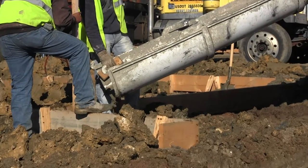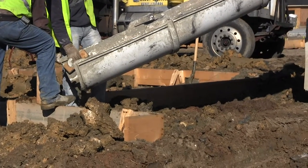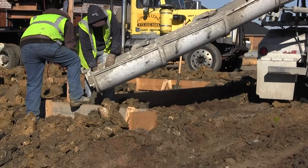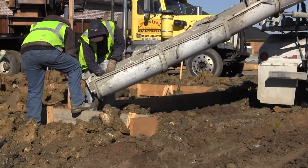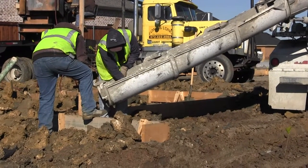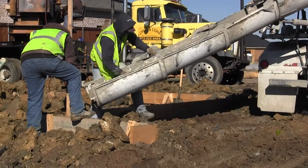By the way, it is January the 26th. The temperature is about 45 degrees with a moderate breeze from the north. We have extremely clear skies and humidity is low — comparatively speaking for our area, it is low. So it's a good day to work. When you're pouring piers in the ground, the concrete is going to set up uniformly. There's no plastic encasing these piers, so the moisture will come out of the concrete and bleed into the soil. Temperature is really not an issue when we're pouring piers.